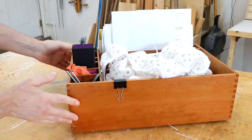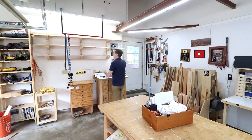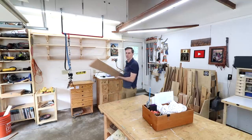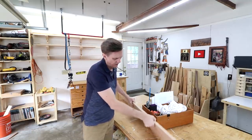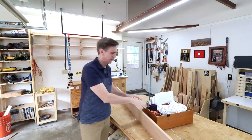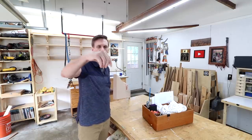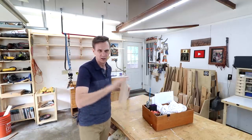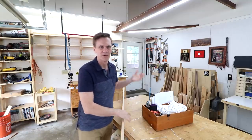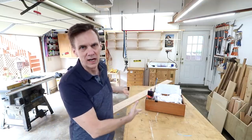The overall size of the box she likes and wants it to remain the same. I want to make it out of solid wood like the original version. I've got a couple of oak boards that I think will work, though they're not exactly as deep as this one — she said that would be okay. I'm going to resaw them halfway through, since I think three-quarter inch lumber would look too bulky for something as delicate as knitting and crocheting stuff. The first order of business is to design the new box, show it to her, and make sure it fits all her specifications.